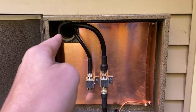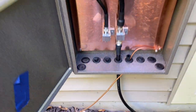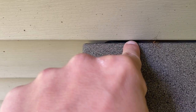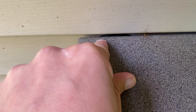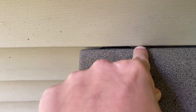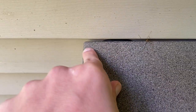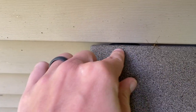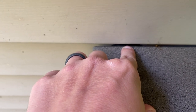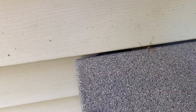This is the window of my shack — you can actually see my shack computers and gear down there — and this comes right through the wall. Coming up here, if you look behind this panel you'll see what looks like some gray putty. So how do I seal this from weather? Two ways: behind the box you do have the option to do some weather stripping. I did not opt to do that — I decided to use what's called duct seal.